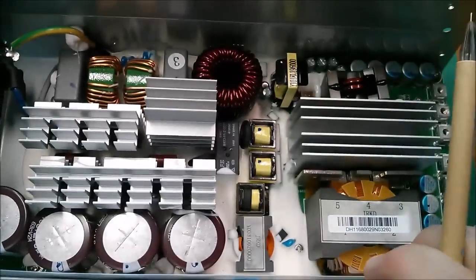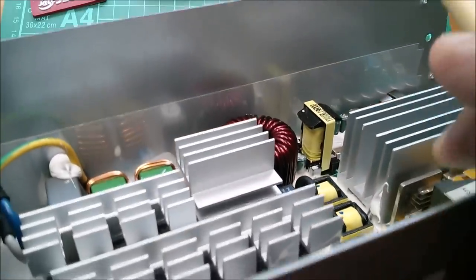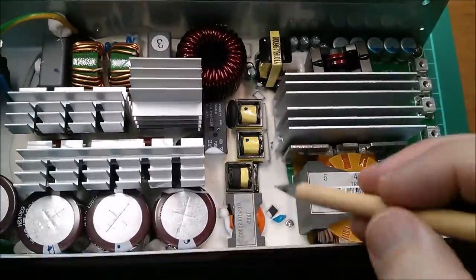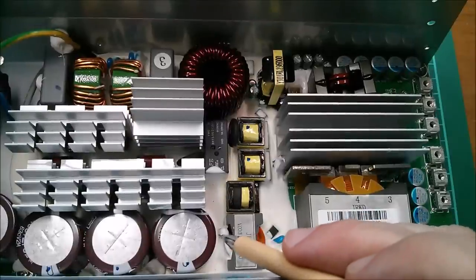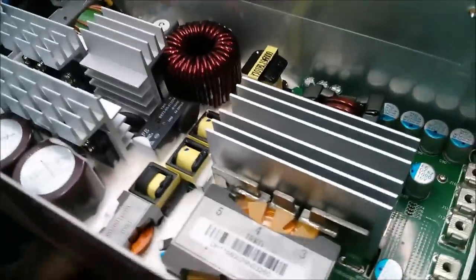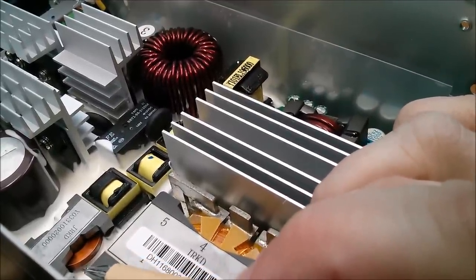That's the chopper that chops up the DC, turns it back into AC, and then it makes its way over to the output side. There's another inductor here which is unusually tall and thin. And down here you can see this one has these flat copper bus bars — they come in and are wound round, and I think this has about eight turns. They're not very thick but they're very broad and flat, like washers.